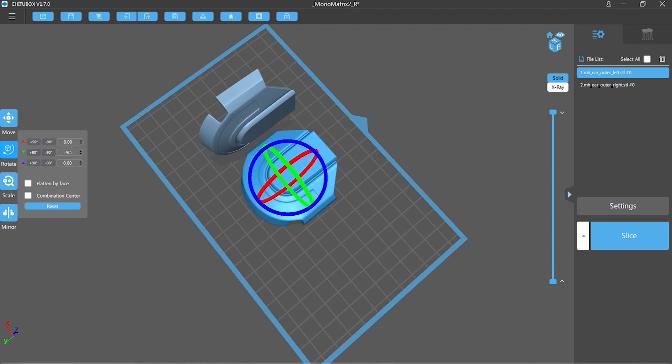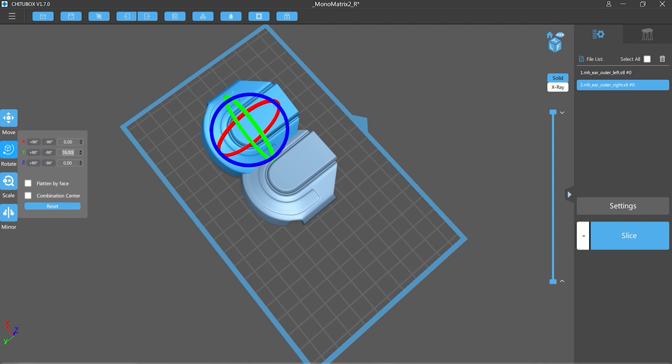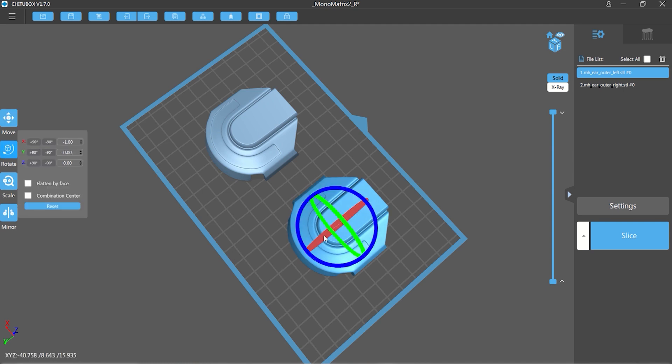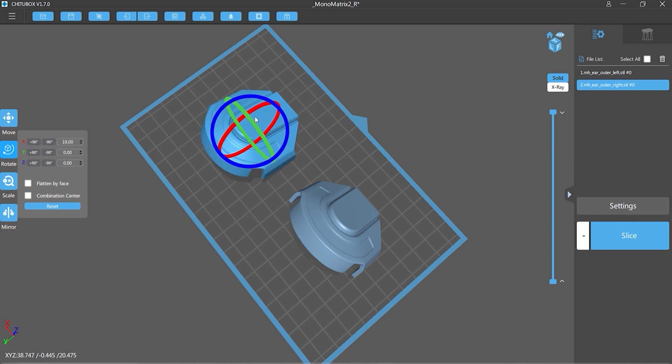You can see that the top of the model is the part that you want to look the best, so it's always best to have that side facing away from the build plate. The reason for that is the supports are going to be on the underside of that part, and where the supports attach is where you'll have all those little marks that need sanding off, so you really don't want those supports to affect the appearance of what's going to be seen on the outside of the model.